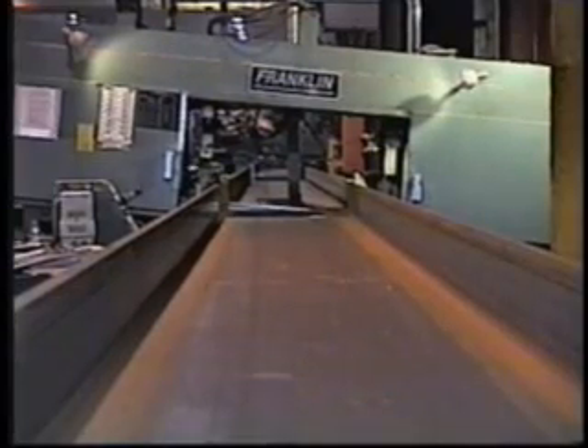The Franklin Model M363C is a rugged, heavy-duty, double-column machine constructed of unitized steel frame construction and featuring full servo control of the force applied to the blade, resulting in increased production rates and extended blade life.